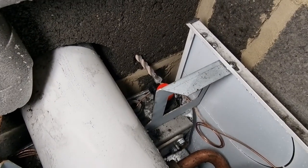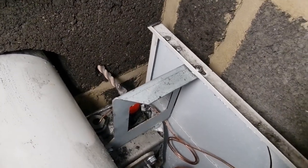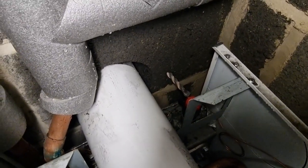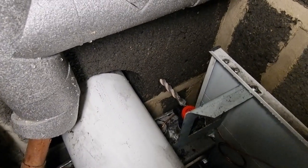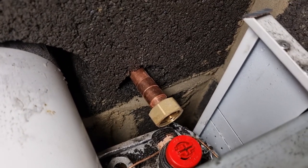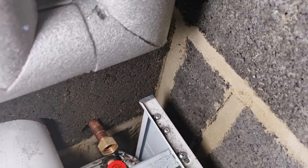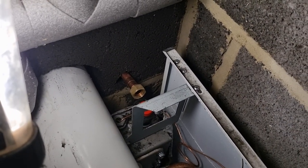I'm just getting the PRV drilled from outside in — not a bad guess for a start, just about 20mm too high but bang in the right place. I'll go through with about a 28mm bit and then just leave it, because it helps to have a little bit of movement on your pipe if you ever have to disconnect it. I've drilled a big enough hole so I can solder the whole part in position and then it'll just push down onto the PRV — making it so much easier if you ever have to replace it in the future.